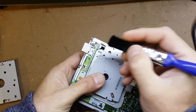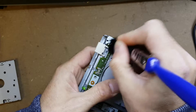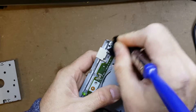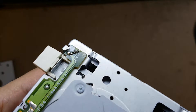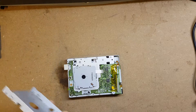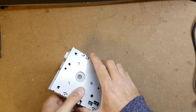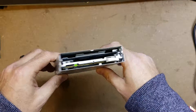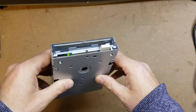As always, best practice is to get the isopropyl alcohol and give it a clean to get rid of the flux residue, and that leaves us with a nice shiny clean joint. So guys, that's a super quick video showing you how to make that slight modification which will stop the requirement to use sellotape on high-density discs. If that helps you, give us a thumbs up and subscribe — thanks again, see you soon!